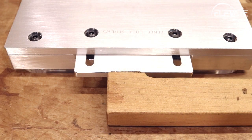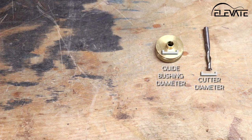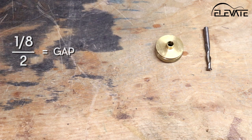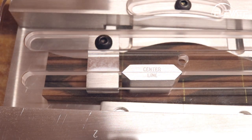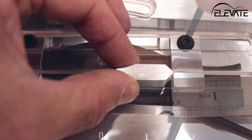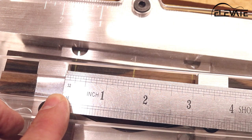The final step is to set the work stops. This will require a little bit of math. We need to know the difference between the diameter of the cutter being used and the diameter of the guide bushing. The included guide bushing is 3/8 of an inch and the slot I'm routing is 1/4 of an inch wide. This means the difference between the two diameters is 1/8 of an inch. Now divide this measurement in half — this is the gap needed between the end of the alignment tool and the work stops, so in this case I'm going to leave 1/16 of an inch. Take the alignment tool and place it at the mark for the end of the saddle slot on one end. Bring the work stop over and set the gap between it and the alignment tool to the measurement just calculated. Repeat this on the other side, then double check your measurements between work stops. In this case, my saddle slot is 3 inches long and my gaps are 1/16 of an inch each, so the work stops should be 3 and 1/8 of an inch apart.